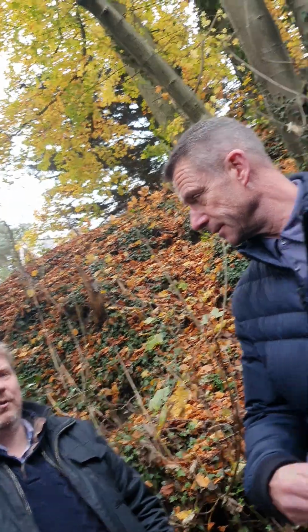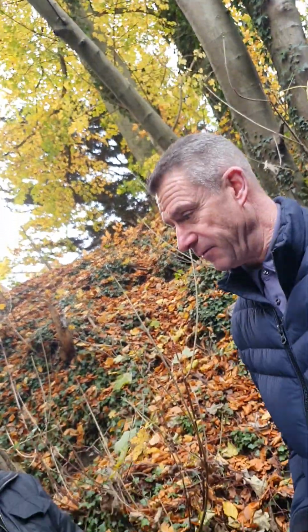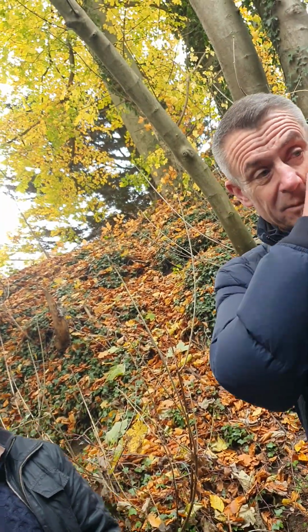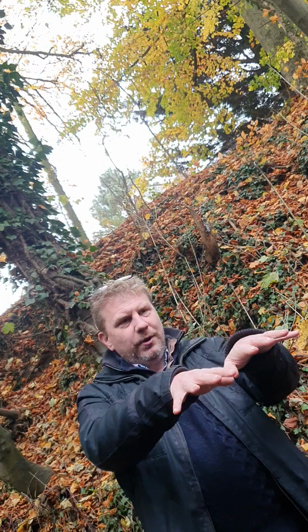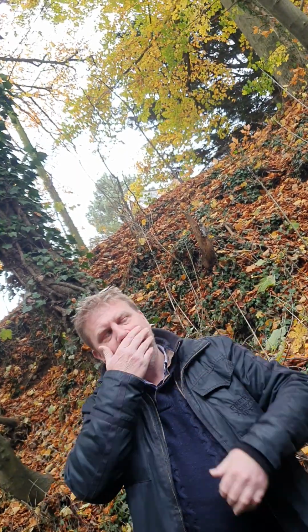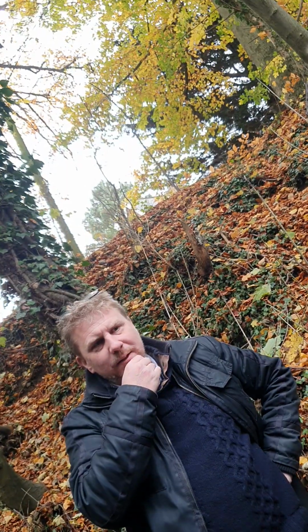I think you can work through small flow. If it's that high, I think you're going to be struggling. Like Rob says, if we sandbagged it, once we've got the first foundation pour in, then we've got a solid base to work off. If we bag off an area, once that's cured enough, then I think you're laughing, because then you can sandbag each wall. So I think the risky element for you guys is just getting the base in.